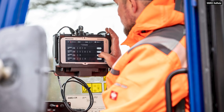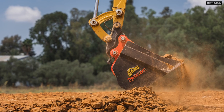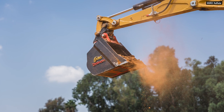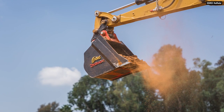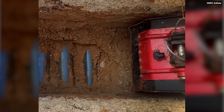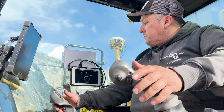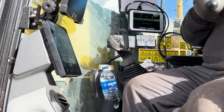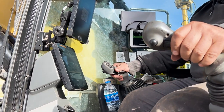What sort of depth limitations are we dealing with? Are we talking a foot or two feet of soil, or only four to six inches? How far down can the ROD Radar bucket see into the ground? Practically, the depth is somewhat irrelevant, because you dig with the bucket and you're getting closer to the target all the time. You need to know what's your safe space with your next bucket. Having said that, ideally we detect everything down to three feet. But like in any other ground penetrating radar, everything affects your capability to detect — the soil type, the utility type. The more clayish the soil, the less distance you see; the more metal in the utility, the better the target can be separated from the background.